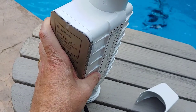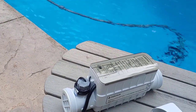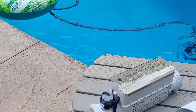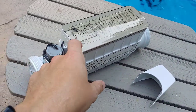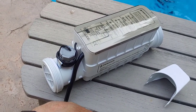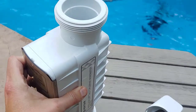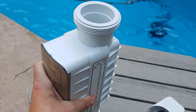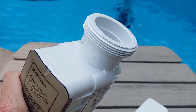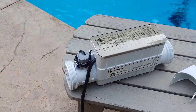That's recommended every three months or so. Truth be told, I only cleaned my other one one time, and even then it didn't seem like it was getting much off. Mine probably would have lasted longer if I'd kept it clean, but when I tried to clean it a few weeks ago, not much came off — so I guess my water has been fairly balanced with no deposits. Once the bubbles stop — about 15 minutes is all it needs — you'll pour this out into an area that is maybe gravel or similar. Don't pour it onto concrete; muriatic acid will etch concrete away.